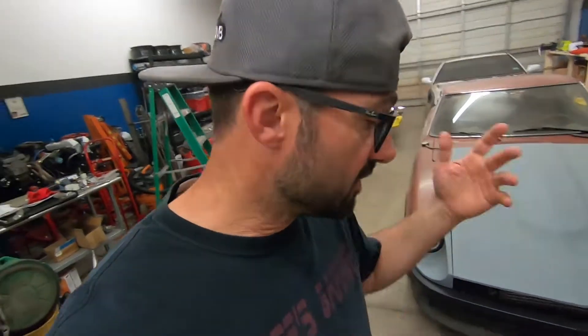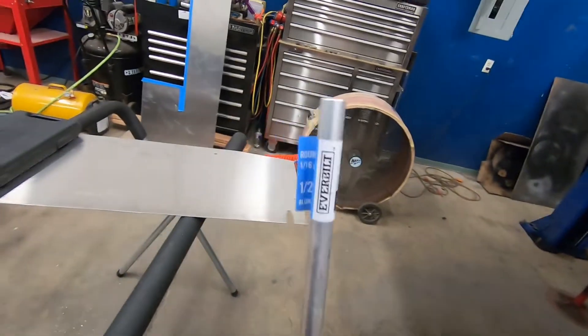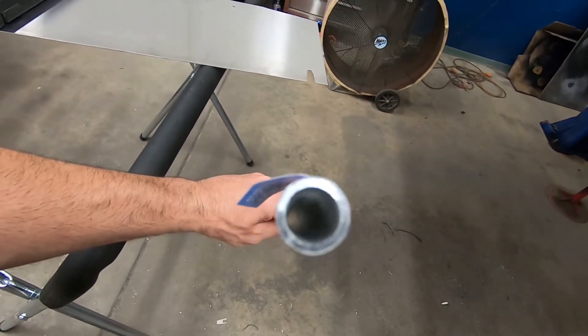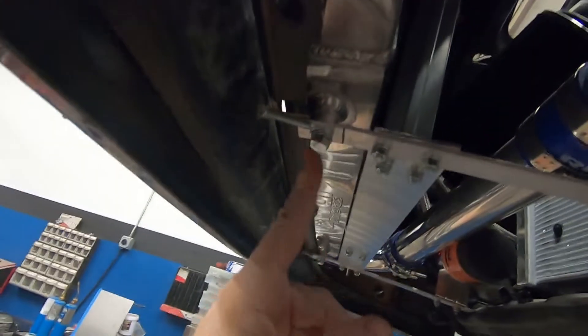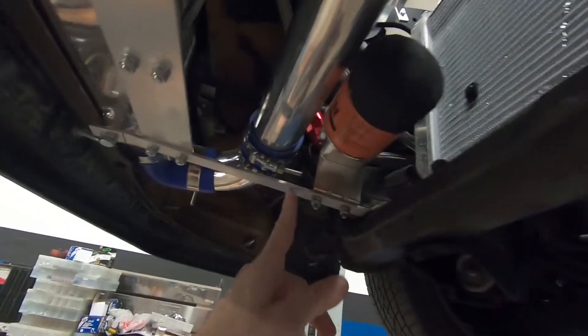Alright guys, it's a new day. By the time I got the materials I needed with this COVID stuff going on, it took longer than expected. I got the tubing in — it's a Home Depot special — and it's big enough to allow an 8mm bolt through. We'll be cutting sections of this off to make the standoffs to give the bottom plate proper clearance for these nuts. I already got the holes drilled out in the front here and here, and I'm going to drill a hole here and one right there. We'll be using rib nuts, and standoffs right there, and that will mount the bottom plate.